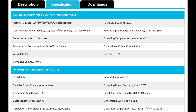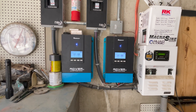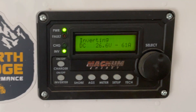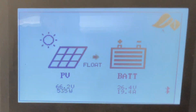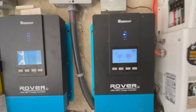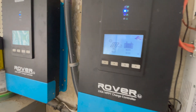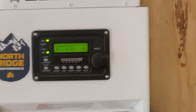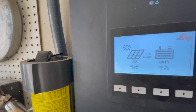I'm gonna show you a little demonstration here. I'm gonna kick on the water — that's a 60-amp load — and we'll watch the power kick up to compensate. There we go: a 60-amp load popping up all of a sudden, and this inverter jumps to 19 amps and 500 watts; this one went up to 24. When that load comes off, the power the solar panels are generating will kick right back down — and there it goes, right back down to 40 watts on that one and 120 watts here.